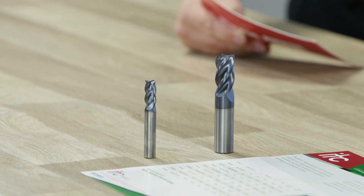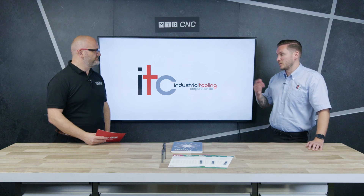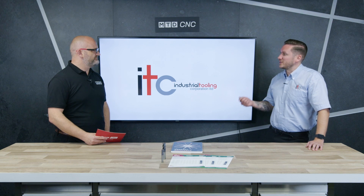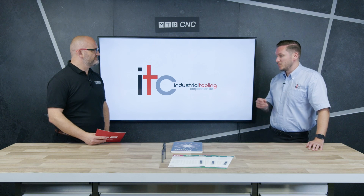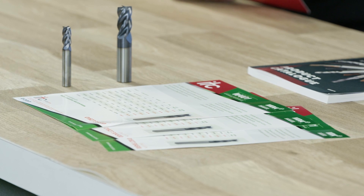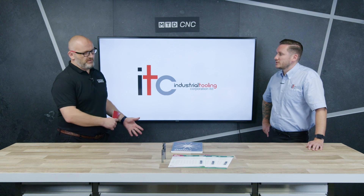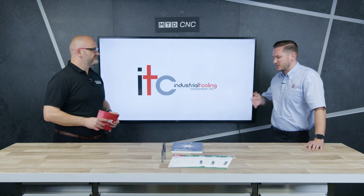ITC and Widia have a huge range of solid carbide tools — so where does this fit within that portfolio? This sits in between the GP and the Varimill Extreme. The GP also has a promo but that's for conventional standard milling strategies. The variable helix WCE4 would be for trochoidal strategies, and if you want to go a step further you'd go with the Varimill Extreme. So if you're a small shop and price-sensitive you go for the GP, and you've got the full-blown top-end option — this sits perfectly in the middle.